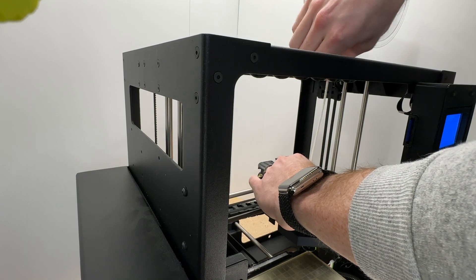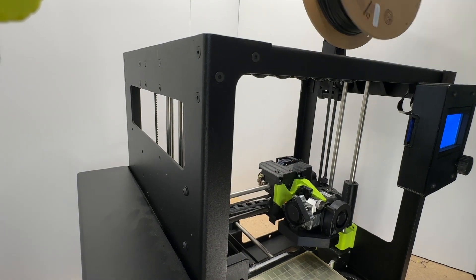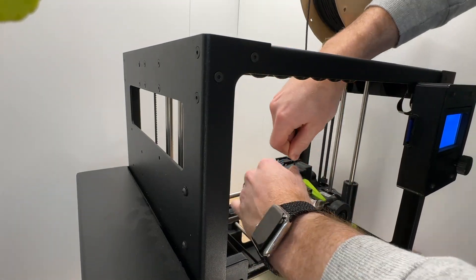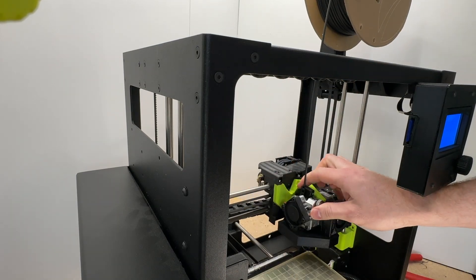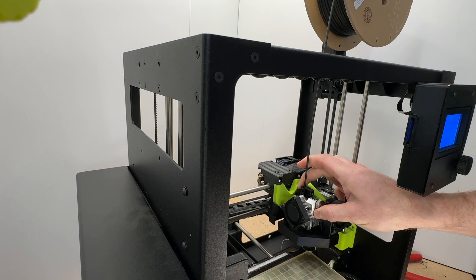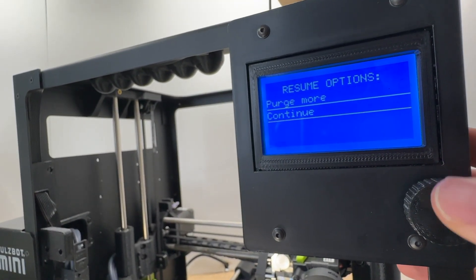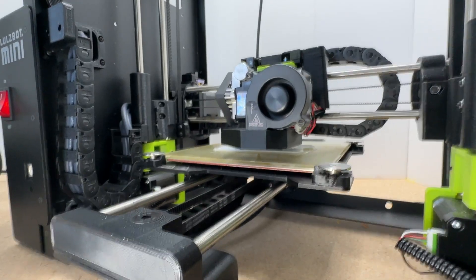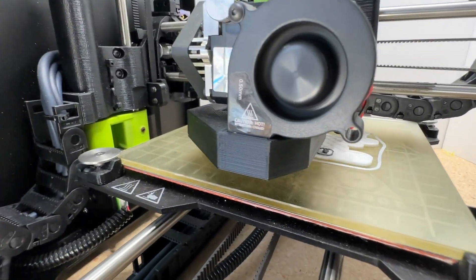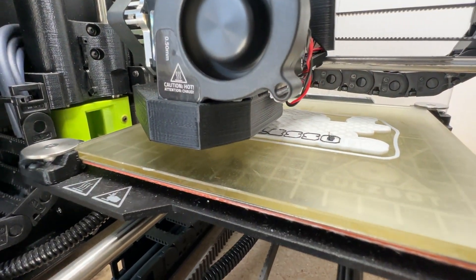My printer automatically paused and now I need to do my filament change. The key is to be as delicate as you can — you don't want to put a lot of stress on the print head. I like to use the little wheel on the standard extruder head to just unwind and load my filament. Make sure that your filament's really pointy when you go to feed it. Then you can use the purge function to purge additional filament as needed.